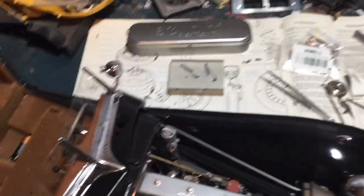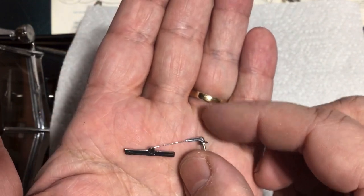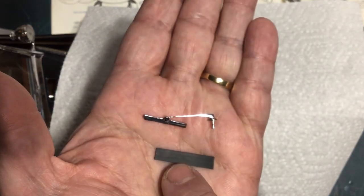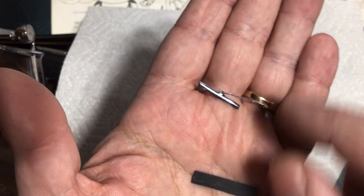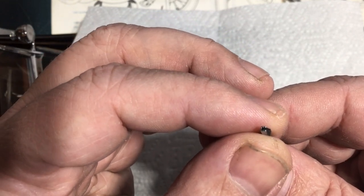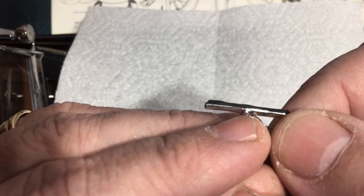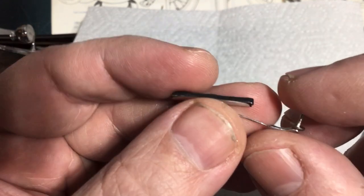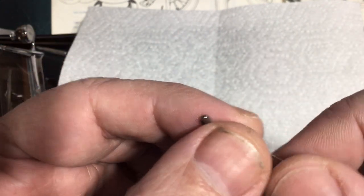There's the rear license plate, rear bumper, and lights all installed — and there's the front. Now for the windshield wipers: the Model Motor Cars wiper kit comes with a strip of rubber and two wiper frame pieces, though you really only need one piece. I cut a strip off each end, and that little strip of rubber gets glued into the channel of the wiper frame. In the middle there's a small obstruction — leftover solder from assembly — so you have to cut a little slot in the wiper blade to clear it, then press it into the channel. I only glued it on the ends.